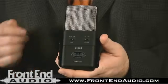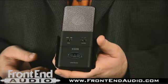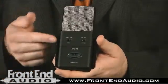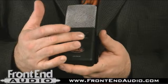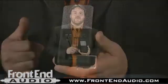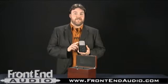Features of the E100S are very simple. Basically you have a minus 10 dB pad, and that relates to this microphone's very high SPL rating. Whenever the pad is engaged, it can handle up to 150 dB — that's pretty awesome. The other feature is the high pass filter, which is at 80 hertz. One really unique feature to note is that it currently holds the record for the lowest self-noise in its class at 3.7 dB, which is very, very quiet.